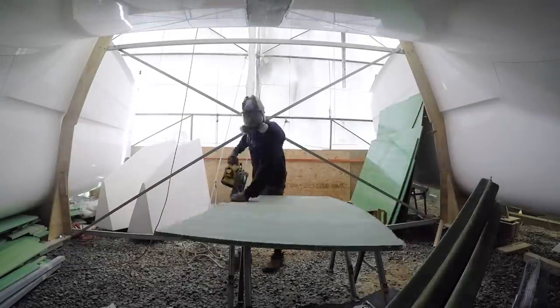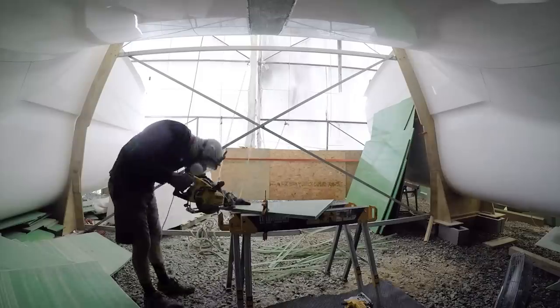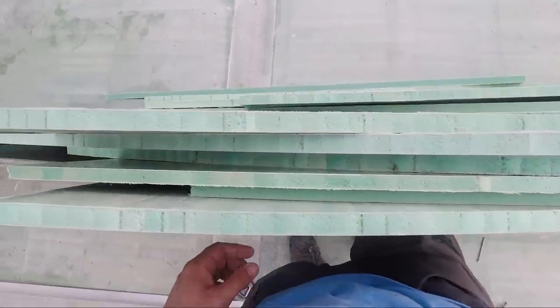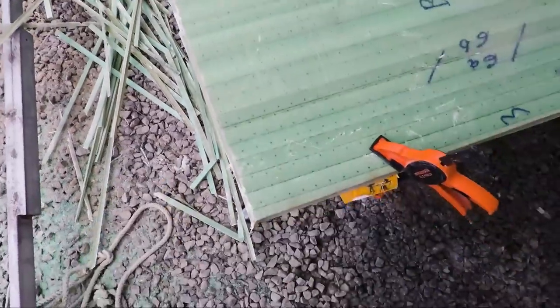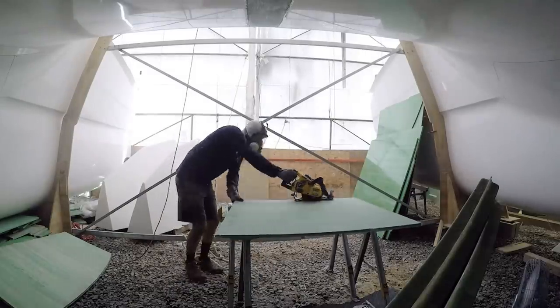Over the past few days we've been preparing the forward webbing to go in. Since most of the structural pieces shipped over from Max Cruz have an extra layer of glass to protect the edges, Matt went through to trim them and fit them down to size. Here's about two hours worth of work trimming these down - it turned out really well. I'm using a circular saw to run along the edge. They're CNC cut and then laminated after the fact, so that extra little glass on the side is actually not needed. I didn't quite realize that, so I've been wasting time with a jigsaw trying to get a smoother edge. This works a lot better. Luckily almost all the other pieces are already CNC cut without that extra lamination on top.